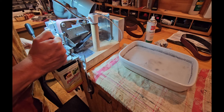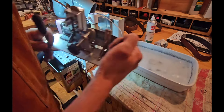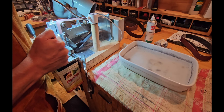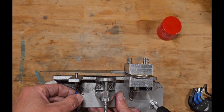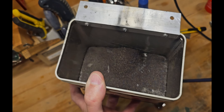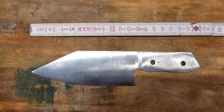Always in between, cooling down the blade in some water so as not to cause any damage to the steel. Then just going and grinding, sometimes letting the grinder cool down a bit. The good thing with this knife jig is that you can just flip it around, keeping the same angle and then going on the other side. You can see it's already taking off quite a lot of steel. This is the finished rough grind — it's not so rough anymore.